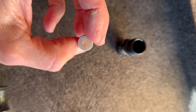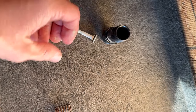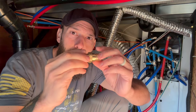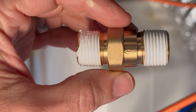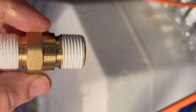You can see right here, this is a little plunger that moves in and out to allow the hot water to flow out or to stop it from flowing back in. It was loose in there, so this is definitely the culprit. We're going to replace it with the upgraded brass check valve right here. We're just going to get some plumber's tape, put it on both ends, screw that back in nice and tight, probably use a socket to tighten it up, get the hot water line back on, fill our tank up, and we should be good to go. Just make sure the arrow is pointing outside of the tank — meaning the water is flowing from the tank out to your water line — before you put this back in.